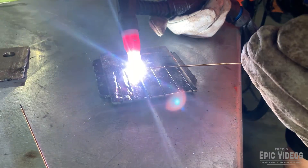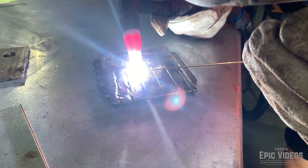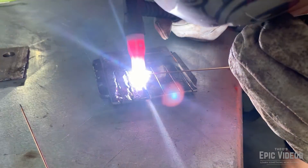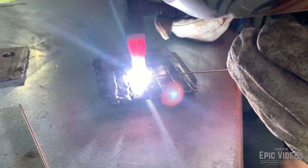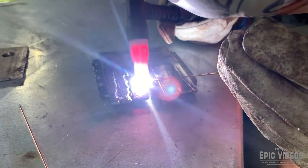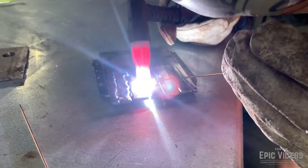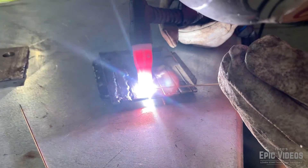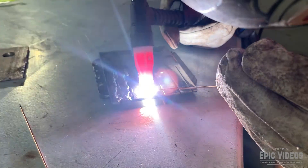What I found was that two seconds of post gas is actually way too short. You need a little bit more, because you'll find there's a little hole in each of the ends of the weld. That to me says there's a bit of oxygen getting into the weld, and obviously that's something you're trying to avoid while TIG welding or any sort of welding.